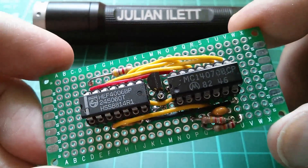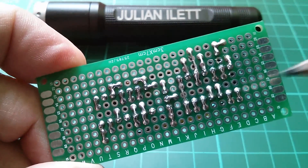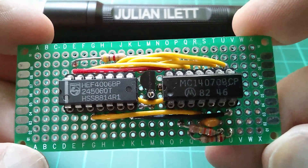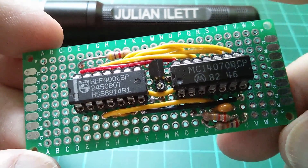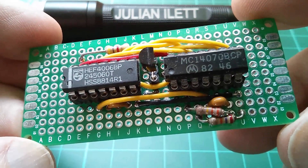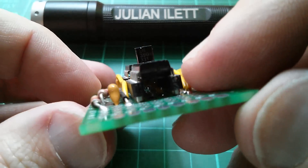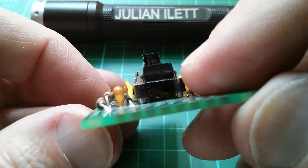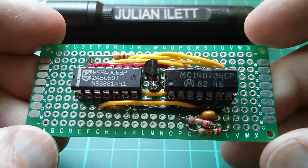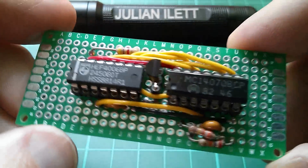I've never really worked with these matrix boards before — I've always used stripboard. It's quite interesting because you can run your tracks in both directions. I've started on the first module for the vocoder: this is the noise generator, the pseudo-random noise generator using the linear feedback shift register, which I looked at in a postbag video not so long ago. I'm using turned pin sockets — single rows of turned pin sockets — so I can put components under the chips as well. I want all the chips to be removable just in case there's a problem. I've even put that transistor in a socket.